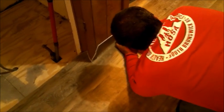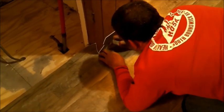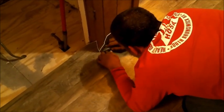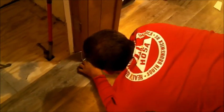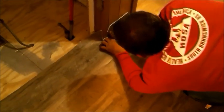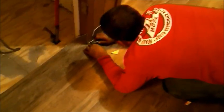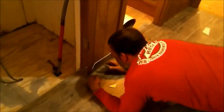Once you get your line going down through the middle of the floor, if you know anything about carpentry work, the rest isn't terrible. You keep pulling all your measurements from that one line, both sides. You mark that out on your paper real nice. Bring that outside and roll that stuff out and just draw what you just did. Leave it a little bit extra for the folds, up the wall so you get nice and tight, except for the leading edge.